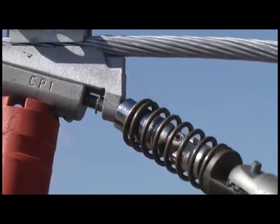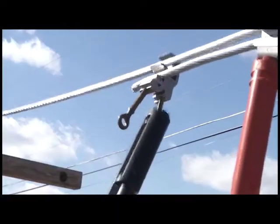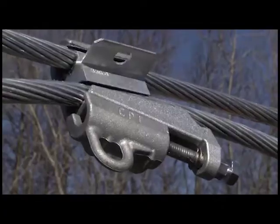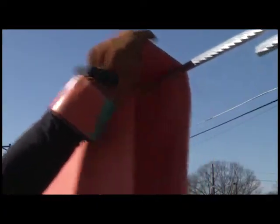There is no need to tighten the secondary bolt head any further. Remove the temporary piggyback clamp from the run and tap conductors. Installation is now complete. Remove all coverings from the work area.